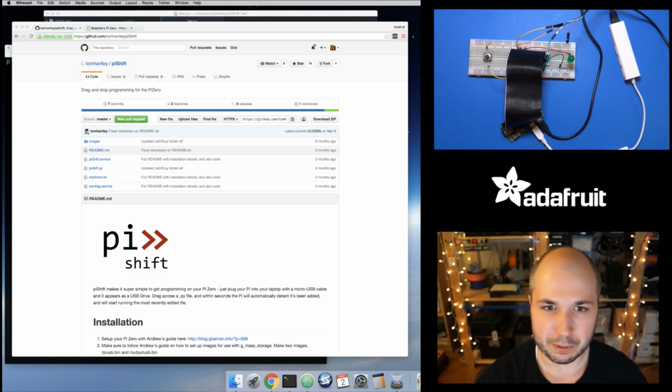So if they have like 4 USB ports on the board, it's not going to work, because the way this works is that this little USB connection that we're connected to is directly connected to the processor on the Raspberry Pi, for the Zero model at least, and the Model A. But on the later ones, like the Pi 3, there's actually a chip that's a USB hub and network adapter that your USB ports connect to, and then that chip connects directly to the Pi CPU. So the Pi CPU can't switch into a different mode to say, okay, now I'm a USB device, unfortunately,